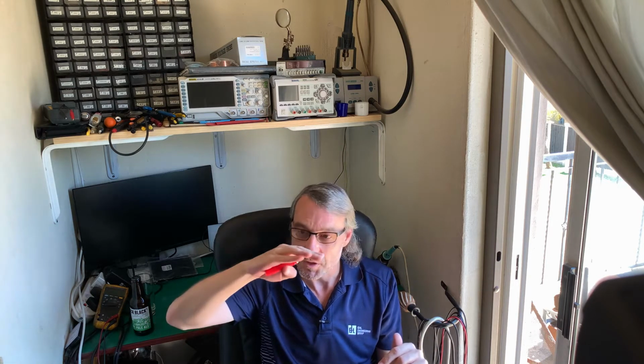Unfortunately, there's a lot of contradicting information out there, and today we're going to look at SEPIC and see if we can make it work with our MC33063 to do what we want, and can we explain it sufficiently. The important thing with SEPIC is it will give you a constant voltage output regardless of the input. The input can be high, it can be the same, it can be below the output voltage. The SEPIC will try to give you a constant voltage output, and that's very important for us.